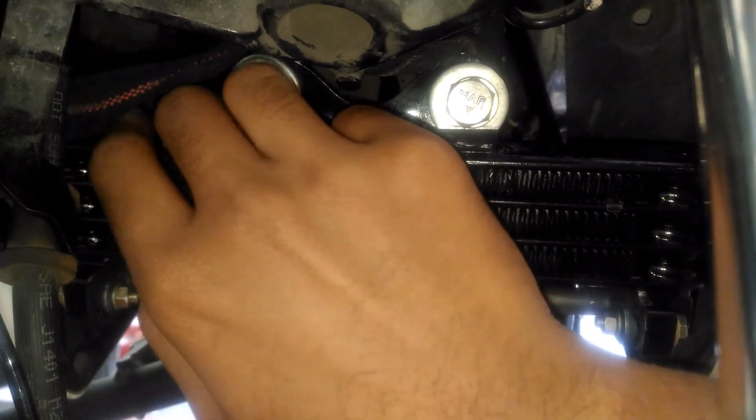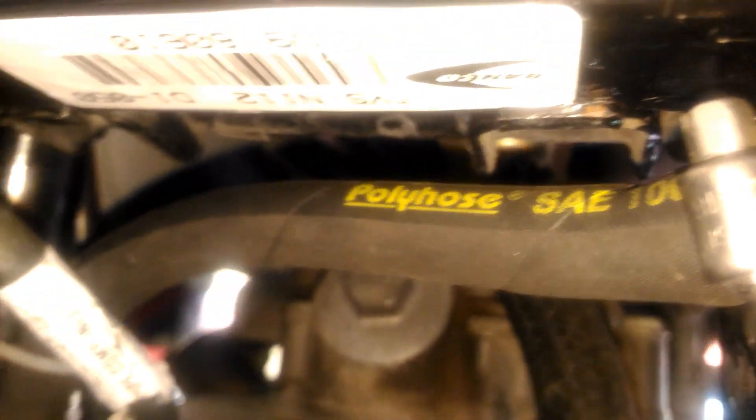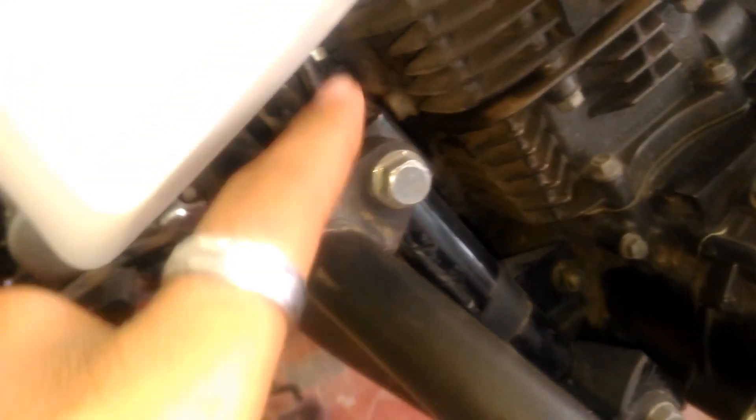I have made the oil cooler seated on the horn clamps, because the horn clamp is in an L-shaped structure. Here you can see the horn clamps — this is where I have placed the oil cooler. This provides better rigidity and stability for the oil cooler so it won't shake or get loose due to high revs and high speeds. Since I removed the horn clamps, you can clamp your horn on the bumper bolts.